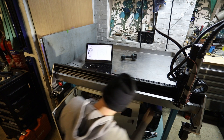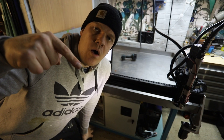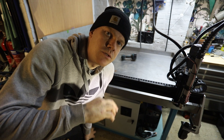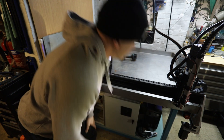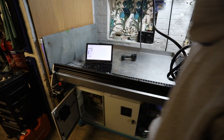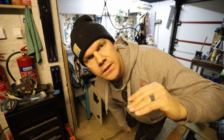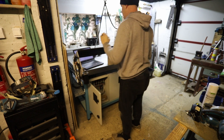So we're going to turn it off quick, connect all these power supplies, all the steppers — steppers are powered. Just got to turn the main power on. This will be the first time that I've powered up the drivers that run the steppers. The reason I've disconnected most stuff is so there's no massive issues. The only issue I can see realistically is if this starts moving, so I need to sort that out first — that's because it's actually sitting on the Z-axis. I've taken out the X and the Z plugs for the drivers so I can test the Y-axis and then chuck it back on — that's the plan.